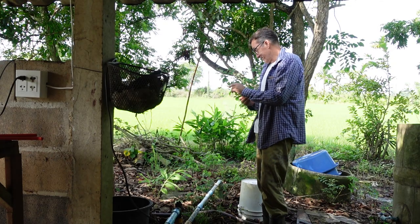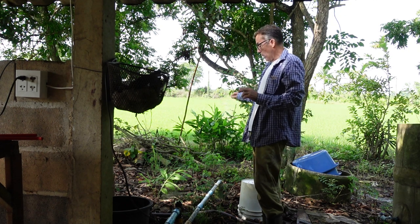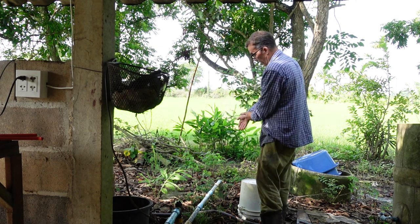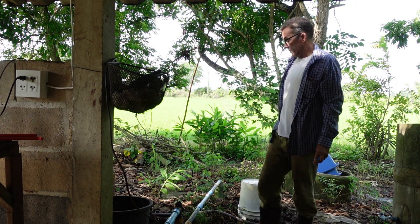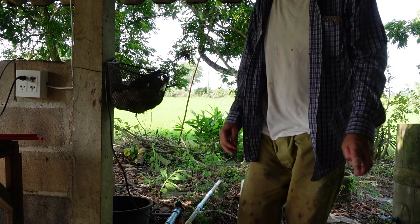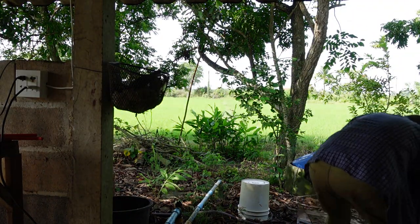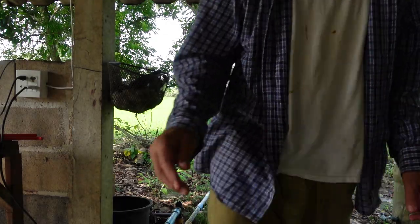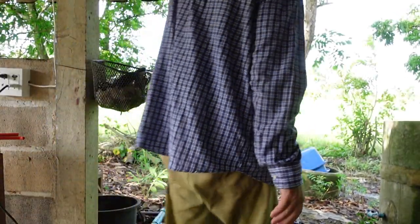Okay, so I had to actually cut it again so I could fill the pipe up with water, basically prime the whole well pipe, and then go ahead and fill from here, which would fill the rest of this so that the whole system was primed. And then turned on the pump, and it was fine. Let's see if it still is. I got the hose over there. Water coming out pretty strong, so yeah. That is the fix for that.